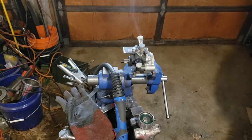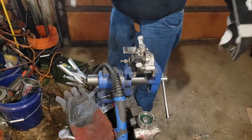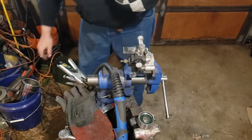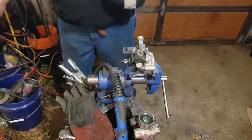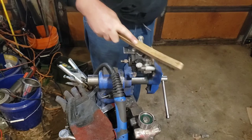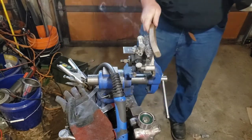I'm going to say this again — you really should be wearing a mask when you're welding anything with zinc, or at least remove the zinc before you get to welding it. Obviously anything that's galvanized, that kind of thing. It's not good for the lungs, it's not good for the body.